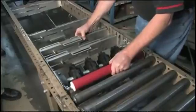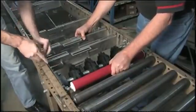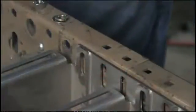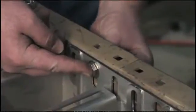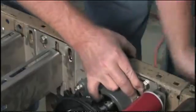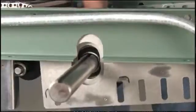The next step is to install our pre-assembled tail shaft and head shaft modules. The modules are almost identical, with the head shaft module having a shaft extension for the speed reducer to be mounted on. We first position the tail shaft module to match the height of the conveyor next to it. After securing it, we'll install the head shaft module in the same fashion, but we have to cut or create a hole in the frame for the head shaft to pass through. It looks pretty good so far — what's up next?